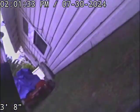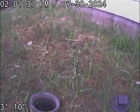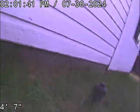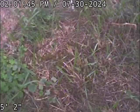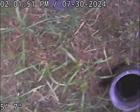We're starting with the ADU shop area, the rearmost part of the property. Out the back side, you've got two different clean-out accesses. My guess is this one is probably for the ADU area, and this one is for the toilet that's inside, the more business part of things. So 3-inch ABS for both of them.